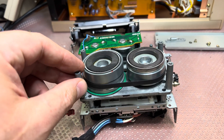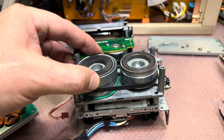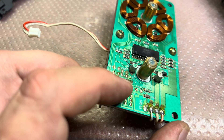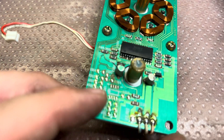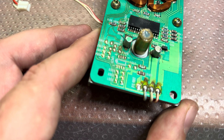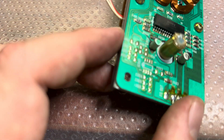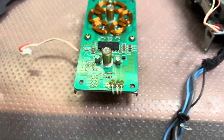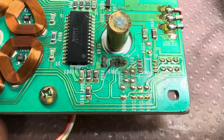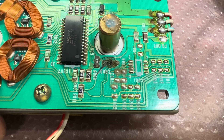Installing the base and both capstans from the 555 — they now sit still without wobbling. Next I have to replace the capacitors. You may see they've already started darkening; this black substance is acid from the capacitors eating the traces. I will clean it up and replace the capacitors. You can see how messy it is under these capacitors — I'll use isopropyl to clean it up and install new caps.